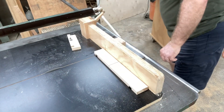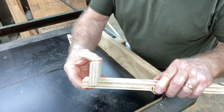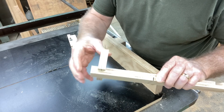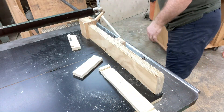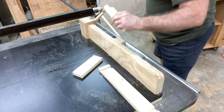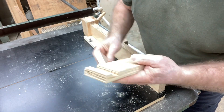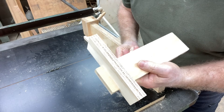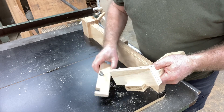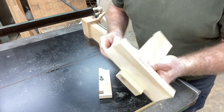That's all done — let's now test it out. We'll turn off the saw, take my little scrap piece of wood, drop it in. That's looking good, but there's a tiny little bit of play. So we'll make one more adjustment — just unscrew it ever so slightly, it doesn't take much to make that change. After a couple of tests and a little adjusting, this is now perfect. This jig will now work for every single dado I need to cut with this saw blade.